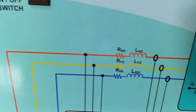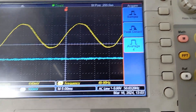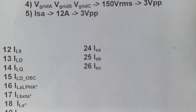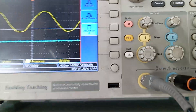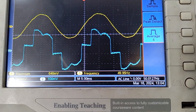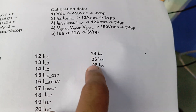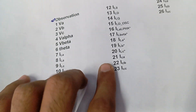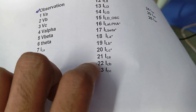Signals 21, 22, and 23 will be zero because we have not started the converter yet. Signal 21 is 0, 22 is 0, and 23 is 0 — these three converter currents are zero. The supply currents 24, 25, and 26 will be equal to load current since the converter is not started. So whichever load is there, the source current will be the shape of load current. These three source quantities will become sinusoidal when we turn on the system.